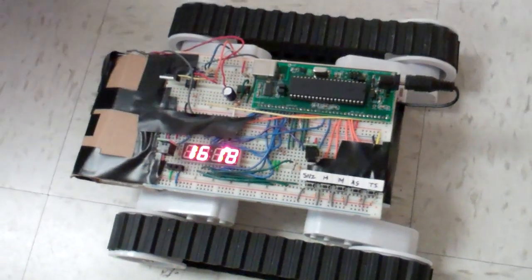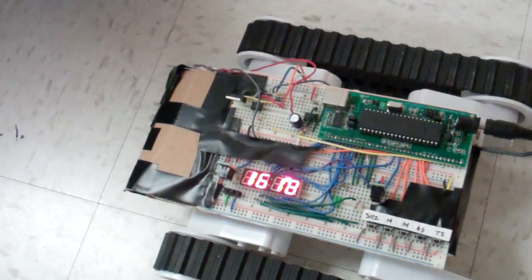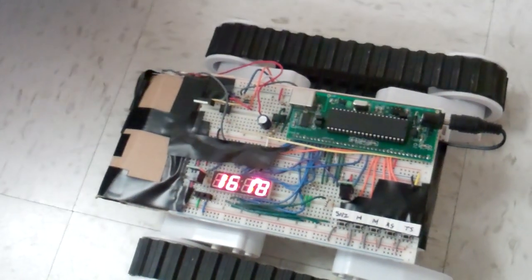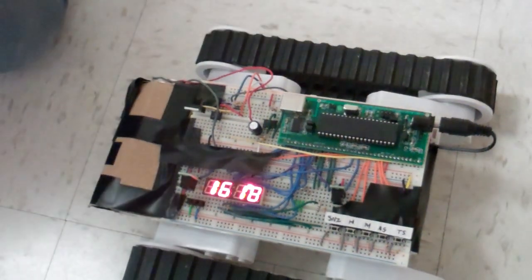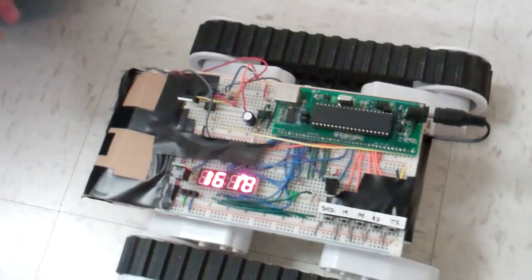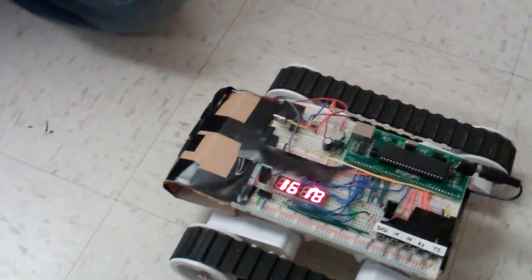The alarm tone is generated by a 555-based oscillator. This is the motor control circuit, which isolates the MCU circuit from the motor power supply. The cardboard on the front is a resonator that allows you to get a little more sound out of the speaker.